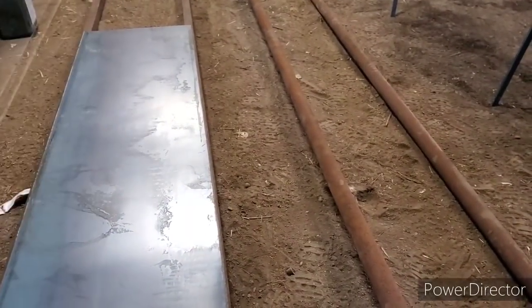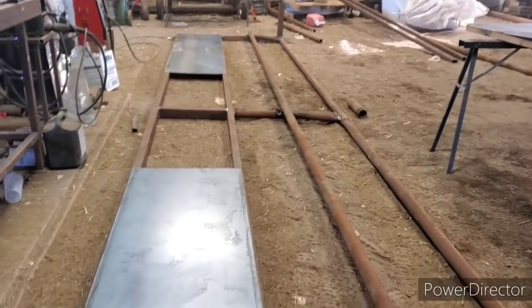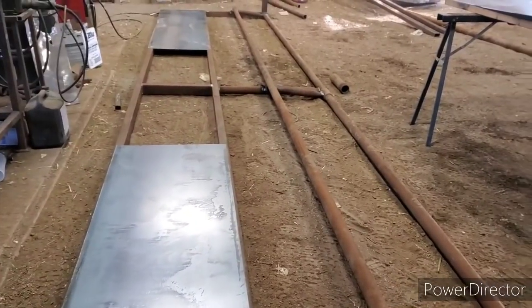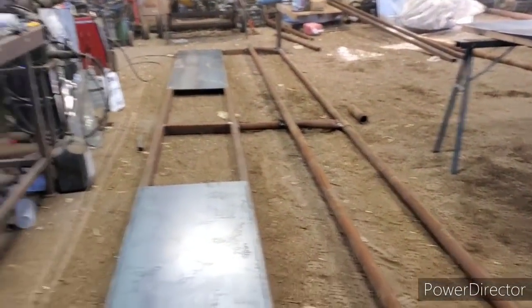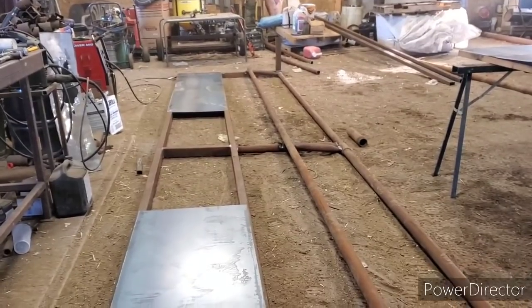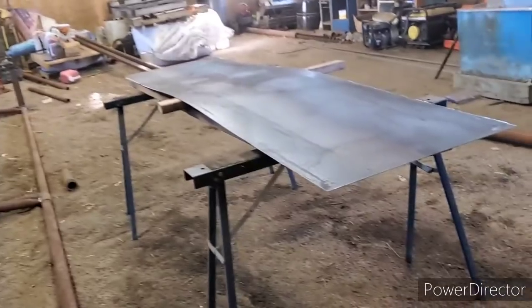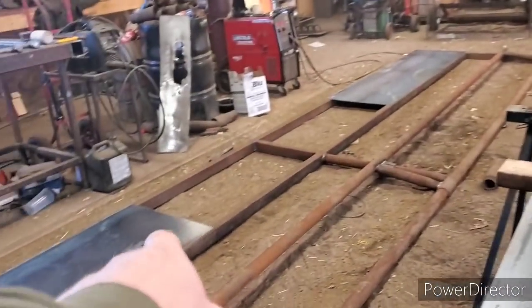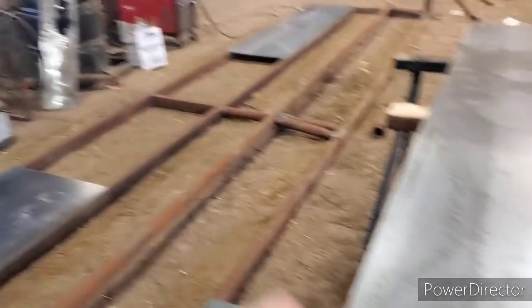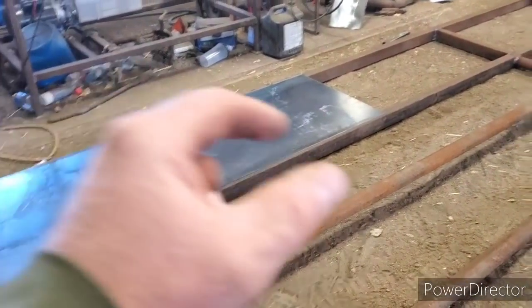You can get 10-footers. If I was doing 30-footers like I'm gonna do for myself I'd probably be better off buying 30-footers — then I can just do three sheets, still have to cut the middle one in half to line up to the middle. I gotta get those squared up, tack them in. Usually I put the cut edge underneath the straight edge of the full sheet — then it hides the cut. Then when I get it stood up I weld the backside with a couple inch stitch welds.